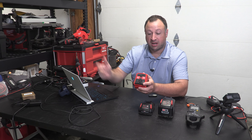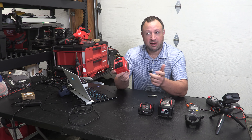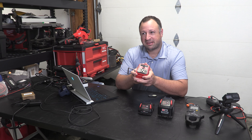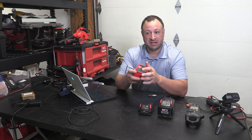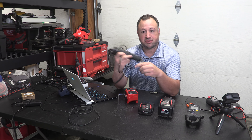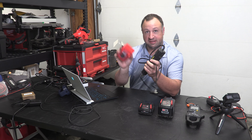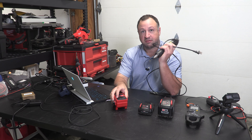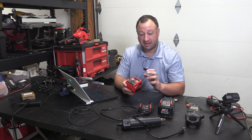When I got this, I figured it was going to be kind of a Swiss army knife that I could bring with me everywhere — I'd always have backup power in case I needed to run my laptop or charge a phone. The fact that you have 175 watts of AC power, I figured could be pretty usable. Now that I've had it for a little while, unless you're really paying attention, things either don't come close to needing 175 watts, or they need well over. We've got the little miniature Wagner heat gun here — great for applying heat shrink, drying epoxy, whatever — and even this won't run off this, because this is 175 watts and this requires 300. I've had this now for about six months.